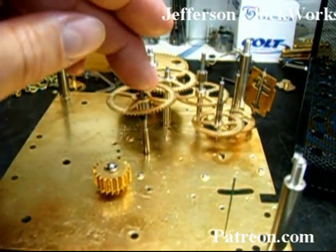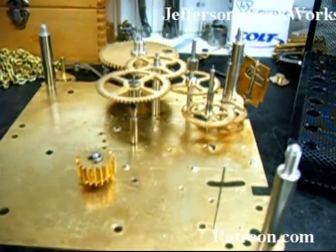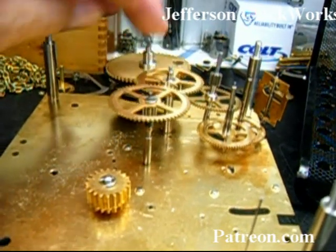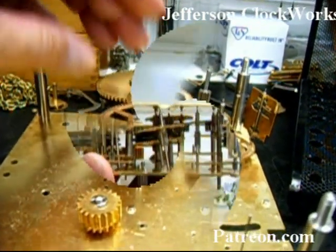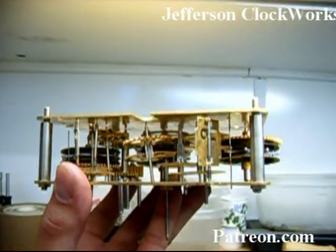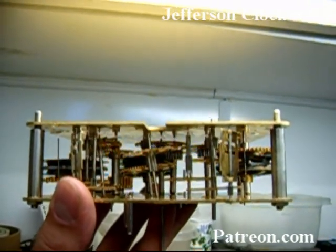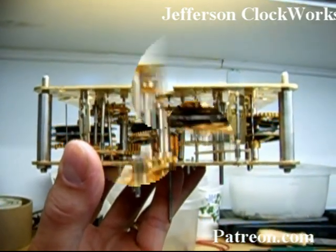I just put the chime side in. Here's the front plate, and from an observation standpoint, here's one that's probably tight enough — it doesn't have much tilt to it. The winding arbors generally have a tiny bit of play in them; American movements have a lot more than that. Now is the time when you're probably going to say, how do I get all these pivots in there? They're all leaning all over the place. Try to put the bottom plate where the winding arbors are in first, put the little nuts on them very loosely, and then work your way upwards into the smaller pivots.